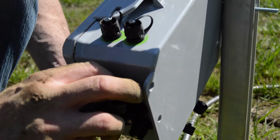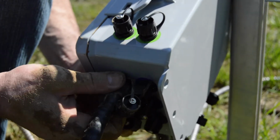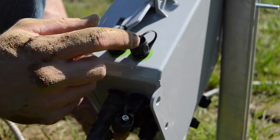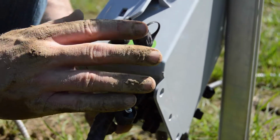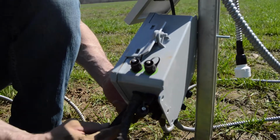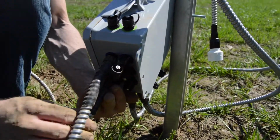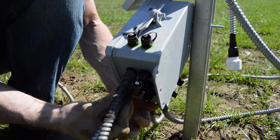These green ones here, just off the subject a bit, are for the digital inputs. If you had a rain gauge, a flow meter or monitor, energy or water there, those could be used for that. Atmometers to measure ET, really anything with a digital pulse can go into those and be configured to be read. These little field node sensors are predominantly used for temperature and soil moisture, but the nice thing about them is they can actually be a little mini weather station if so desired.